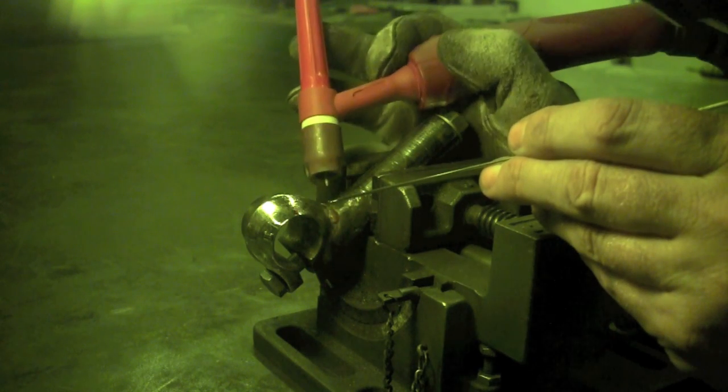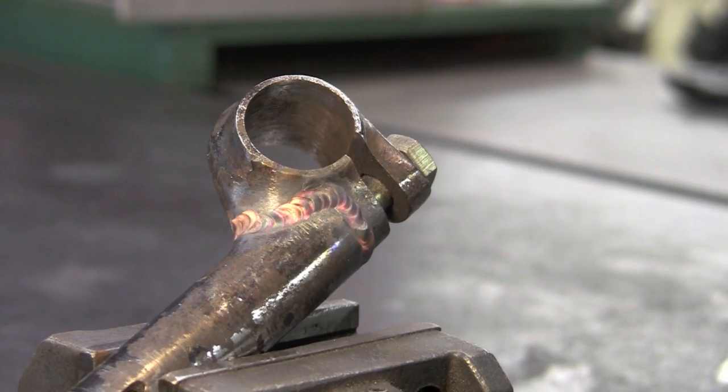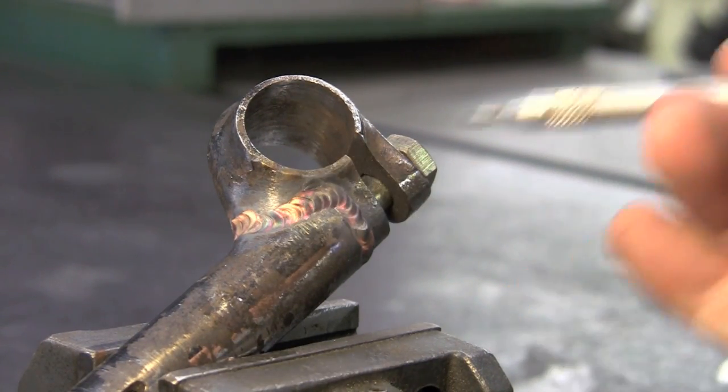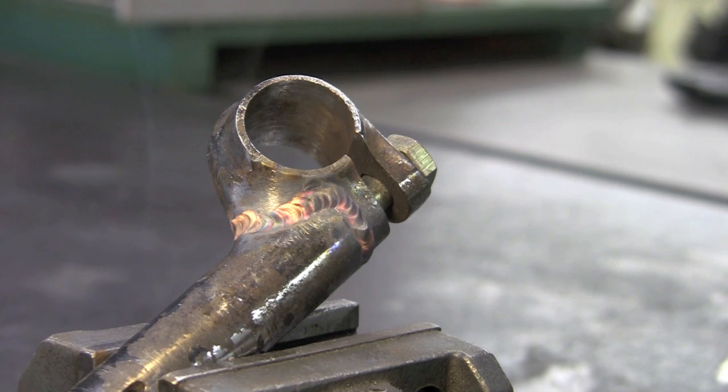Ended up doing six tacks symmetrically all the way around the gooseneck, and now I'm welding from the left side from tack to tack, then going from the right side from tack to tack, working my way around pulling the heat symmetrically throughout the part. As you can see, we got it all welded up with a nice uniform bead pattern all the way around. I don't know if you can see it on camera steaming, but it is hot — it's pretty much heat soaked.